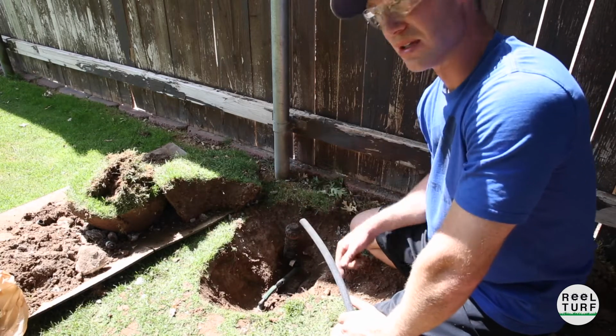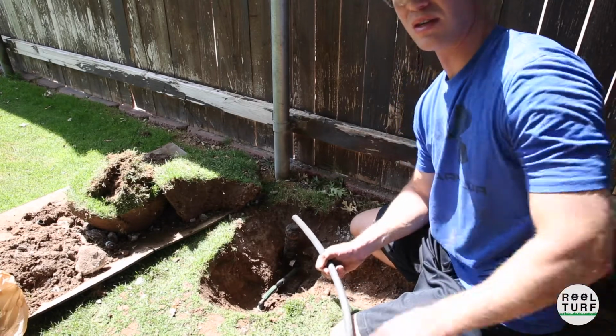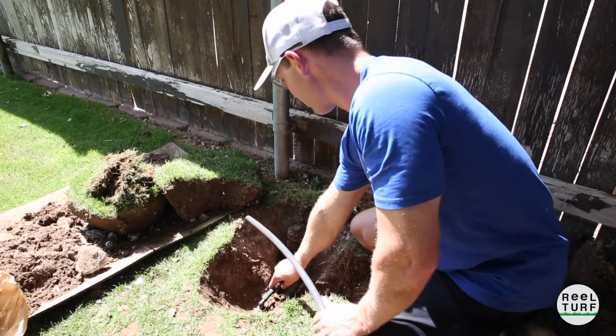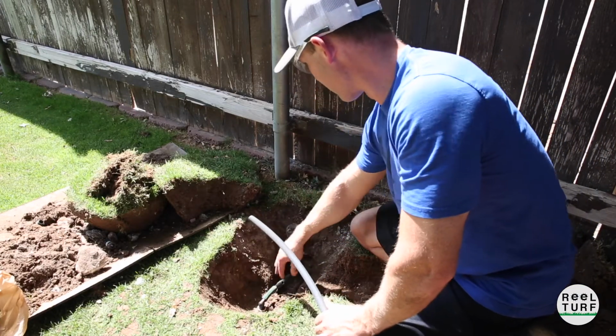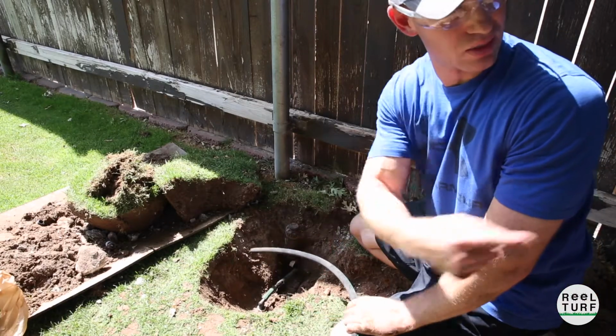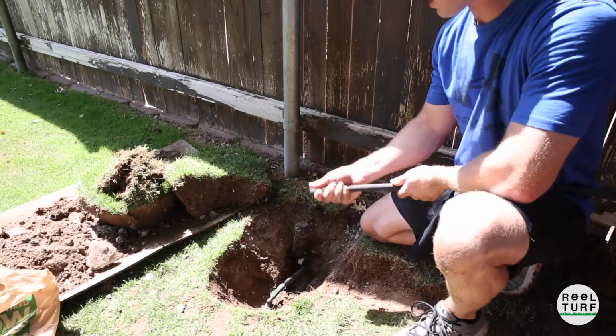Not only that, I'd have to be 10 inches deep, which is going to be really hard for me to do here because I've got main trunk lines that run up and down through this area. So I'm going to use swing pipe, move the sprinkler back about 1 foot like I mentioned before. Then I'm going to come off of this T and move it back toward that corner that we dug out earlier. So here's a little tip for the swing pipe.